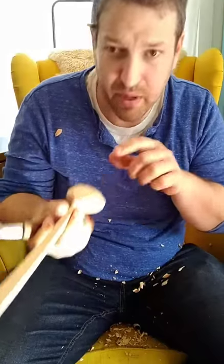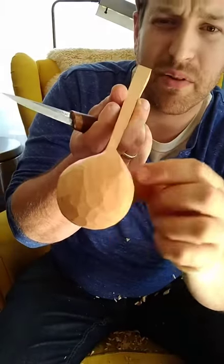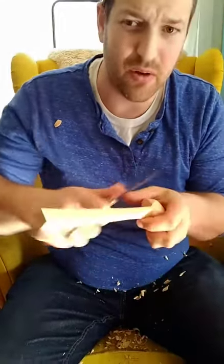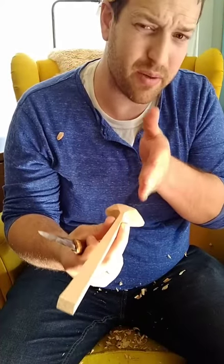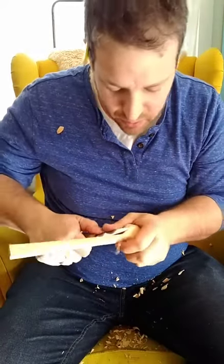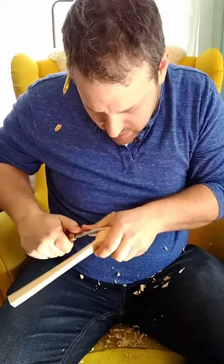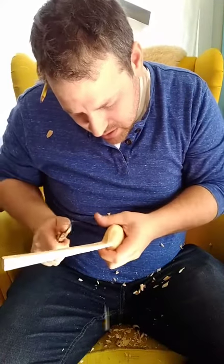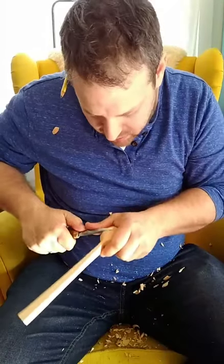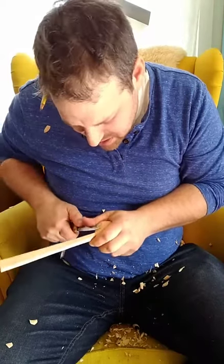One thing I've noticed is that depending on whether you're right- or left-handed, this bit at the back where the handle comes down — I've only carved one side of it right now — because you carve differently on each side it will skew one way or the other depending on whether you're a righty or lefty. You just need to be aware that it's going to skew and then adjust for it. Because these cuts on each shoulder are slightly different hand functions, it's easier to remove material from one side than the other, so if you use the same pressure you'll end up with an uneven spine on the back of your spoon.